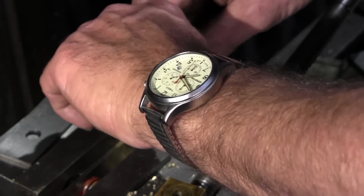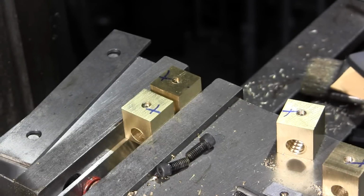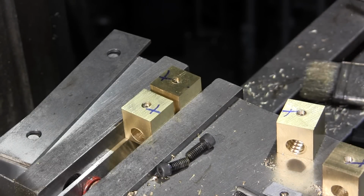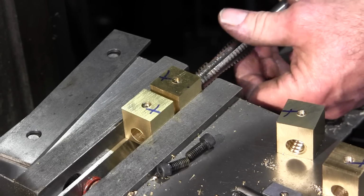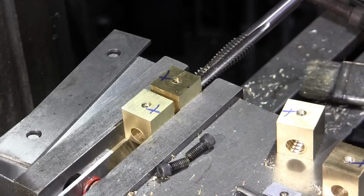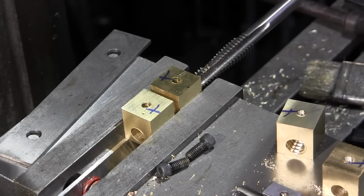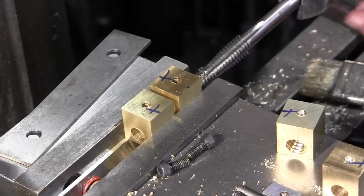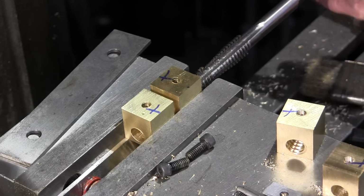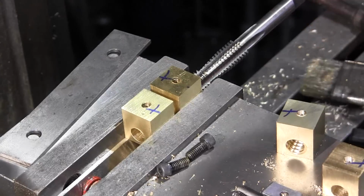All right, so now we take our screws out so we don't score our tap, and we move our calculator and stuff, and we go ahead and feed our tap in from this side here. And now we can lube down through those Allen screws as well. We're using our new high-tech Snap-on 12-inch adjustable spanner. This one here was a gift from my mom several years back.